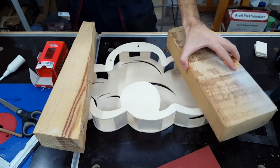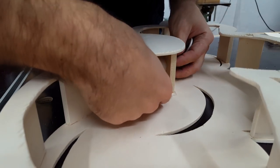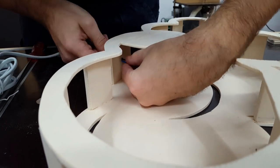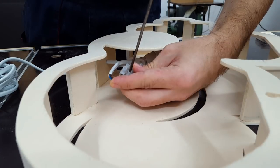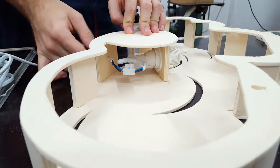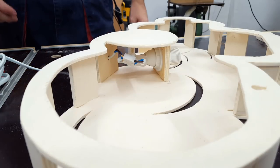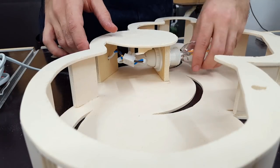And so we already arrive at the final step of installing the bulb holder. After filming this, I noticed that it was still possible to pull the cable out of the bottom of the lamp and that way expose the inner wires, so I went back and tied the cable into a clip to make sure that couldn't happen.